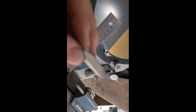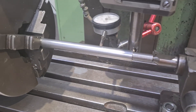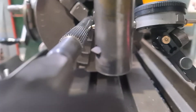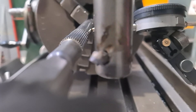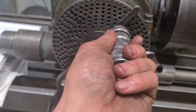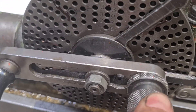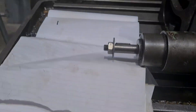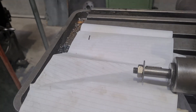It's important to get that right because I wanted this to be a perfect fit — being a steering component, it's the last thing you want to fail. The reason I had to make my own shaft was because you're not allowed to do any welding or any type of joints in a steering column shaft, which made it a bit tricky. Over at the mill, you can see it running down the side chopping it out. There were 36 teeth per end so this took a few hours. I used a dividing head to get the spacing correct between each tooth, so when it came back to the start it had the 36 teeth and the tool would perfectly go down the first groove — that's how I know I've got the perfect spline.